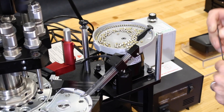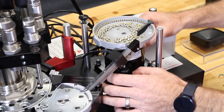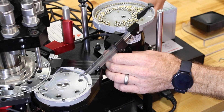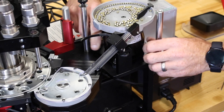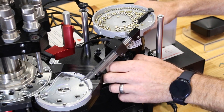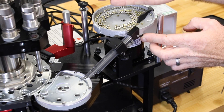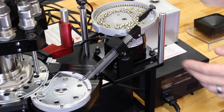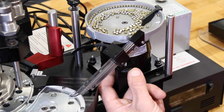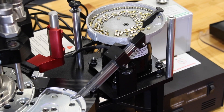Our end goal is to make a nice transition from the primer bowl to the primer ramp. Once I've got that gap set, I can tighten these down — they're on rubber isolator grommets so they don't require a wrench. There is another adjustment on the hood itself: via a screw underneath, I can turn the hood left to right to line up better with the ramp, as well as the ramp height adjustment right here, which I can raise or lower to ensure everything is lined up for a good smooth transition.